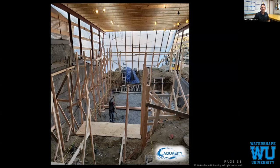A couple weeks later, they finished excavating down. They're about halfway in the last picture. This guy, a normal size human, just allows you to see how deep this is. These are 16 foot 2x4s. We handpick all our 2x4s just to make sure that our full height one-sided forms are as straight and as perfect as possible. We've staked into the ground, staked in halfway because it's so tall, staked in again. Luckily our stakes fit through the holes in the mesh over here.